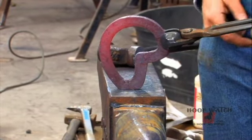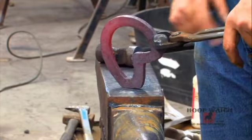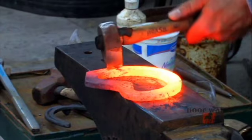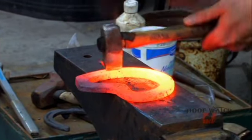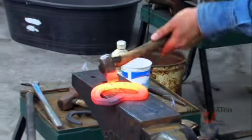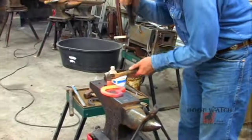So now you can imagine this as a portion of a shoe with that portion of the foot missing, and all that's left now is to fuller it. So we'll fuller right around from heel to side and then put a bunch of nails in it. All right, we're going to fuller around the shoe. Just like we did in the ring exercise on the straight bar video, we're just moving that shoe under our creaser.